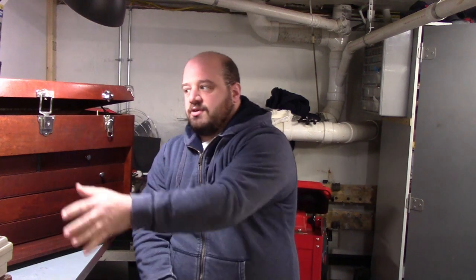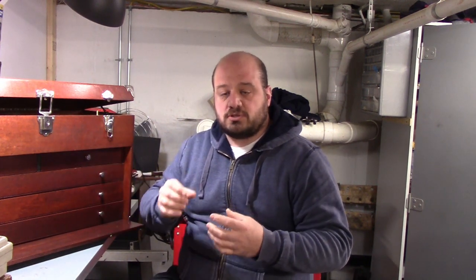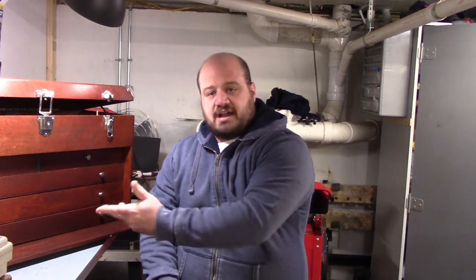I started off after I already sanded everything — I actually wasn't going to make a video on it, but then I decided to. So we're going to come in on this being 100% sanded, stripped, and cleaned. What I'm staining the box with is a water-based soluble dye powder. You take the powder and mix it with water. I did 50% of the mix that it says on the bottle, which was good because I had another piece to match and I was able to use the other half for that.